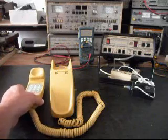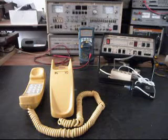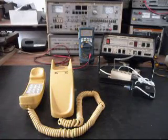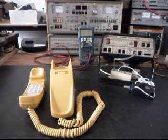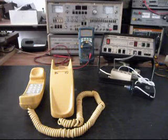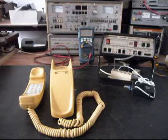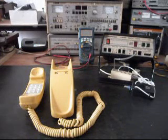The problem is he needs a way to connect this telephone up to the wall, and he's talking about that in his note. We're going to install a modular line port in the base of this telephone so he can simply walk up to it after he hangs it and plug any length line cord, any color that he chooses. It makes for a nice, clean connection. And if the line cord is ever damaged, he can just simply replace it. We want to put a modular port so he can plug any line cord into it — that's a better situation than just hanging a cord out of it.